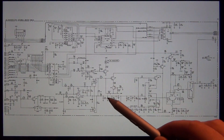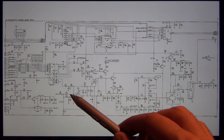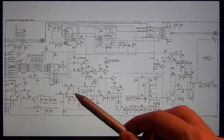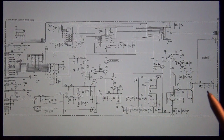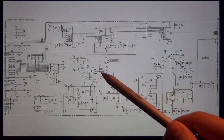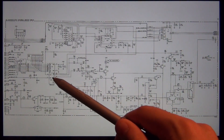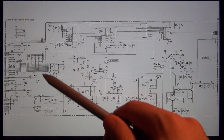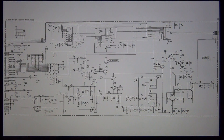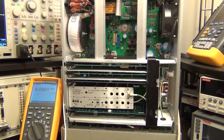Remember the MDO is 50 ohms, which should be fine because this output is also supposed to be into 50 ohms. Let's take a quick look at the MDO. We're now looking at the time domain signal. Let's enable the RF channel. We know the synthesizer goes from about 300 MHz to 350 MHz, so I'm going to set the frequency span — let's start at 250 MHz and stop at 400 MHz. We should change the reference level to 20 dBm, which will automatically enable attenuation at the input to make sure the instrument doesn't get damaged. There's 20 dBm vertical. Now let's turn this bad boy on. Ah — oh, look at that! 295 MHz right now, which is at the lower frequency. There you go, it just jumped to 350. Look — it's searching! It's working!